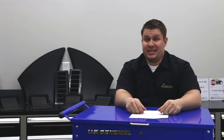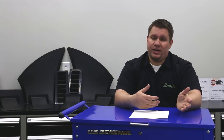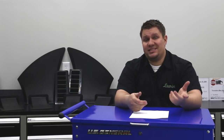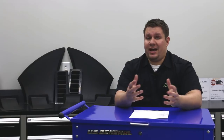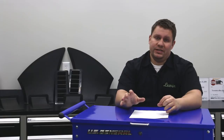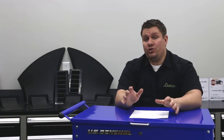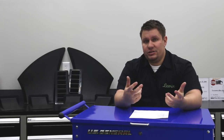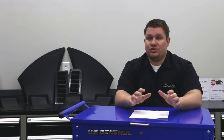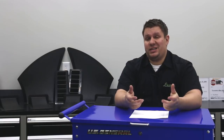With these five options, it really comes down to stiffness, weight, and price. Obviously the carbon honeycomb is going to be the lightest and the wood is going to be the heaviest, but the carbon honeycomb is 10 times the cost of the wood — so you have to make that decision for yourself. For us, we generally gravitate towards the wood or the alumalite. Most of our car is alumalite, and our newest splitter is actually made out of wood.